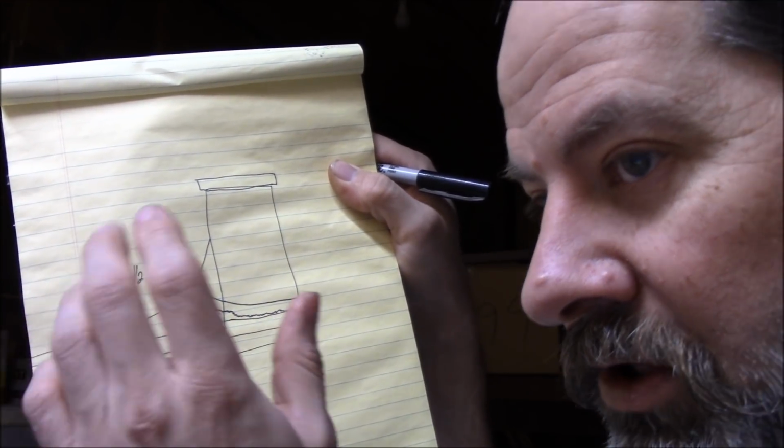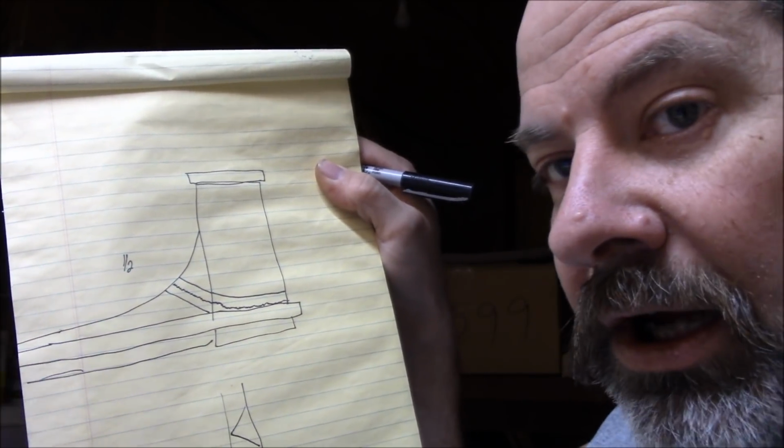This technique is not uncommon. Guys, if you go out in the woods and you think you can lay welds over the top of it, you're sadly mistaken. It won't last. I see this all the time. This is just advice for people out there. I see people put plates. They never grind underneath. They never repair the weld underneath. They think, hey, I'm just going to put a plate on top. Doesn't work. It never works. It works for a while. Looks good, maybe. But you got to get that crap out of there. You got to get down to the bare bones of that crack.